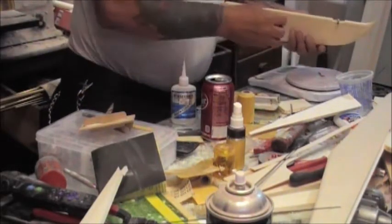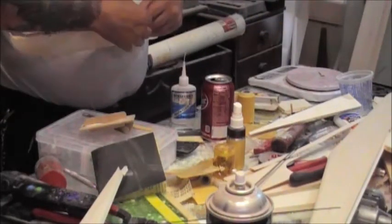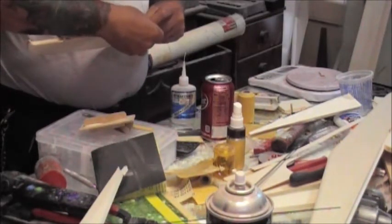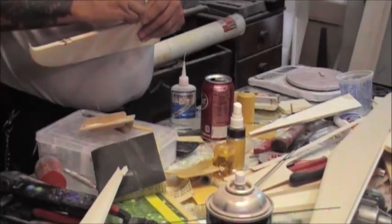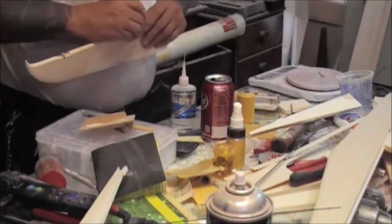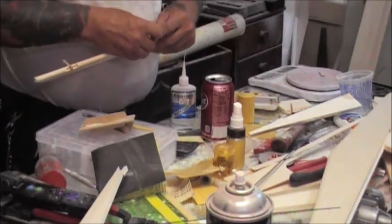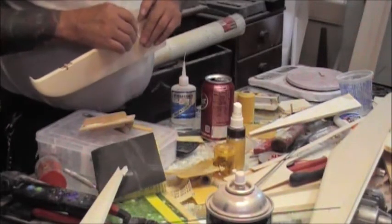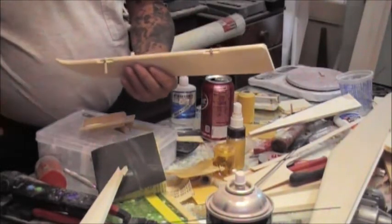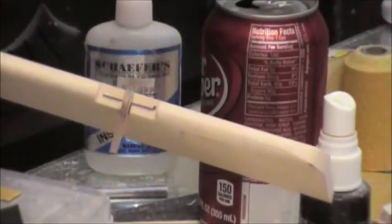The hardest part is what I'm going to show you next, which is filling this with wood. You have to fill it with wood to make it look correct. And these are finished before they're installed. And the install process is relatively easy. Just drill 2 holes. So now we have 2 hinges. These are called pocket hinges. Installed.